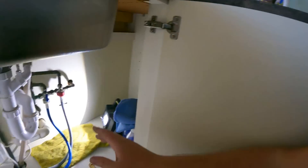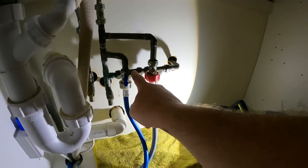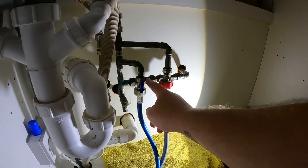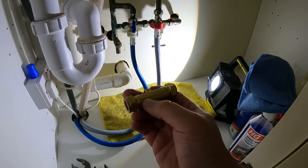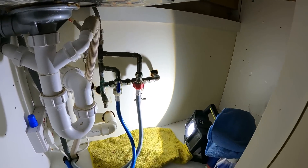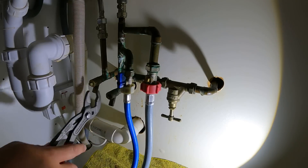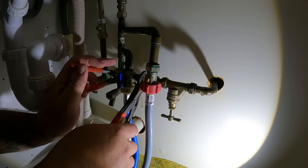So the central heating pump's done upstairs, we've turned the heating off, everything's running fine. On this property we've also just got to switch out the double check valve - the customer's bought a replacement because he thinks this one's playing up. The flow rate to the outside tap is poor, and sometimes inside there's a plastic check valve with a ball and a gauze that knackers up. So we're going to switch that one out. Hopefully we've got enough play on the pipe to get that out - it might be a little bit fiddly but we'll give it a go. We've got the water off, let's get some little grips in there.